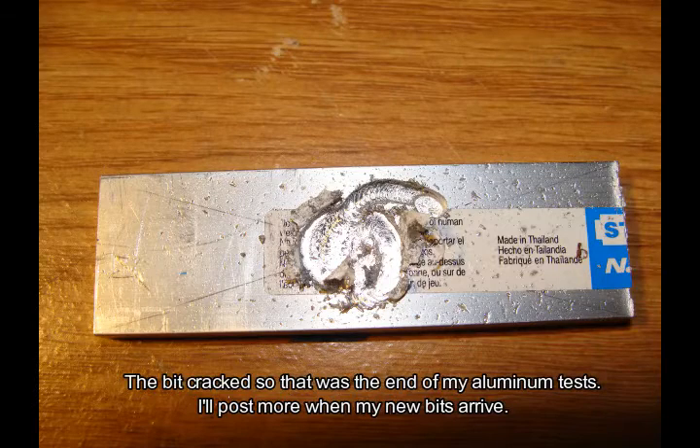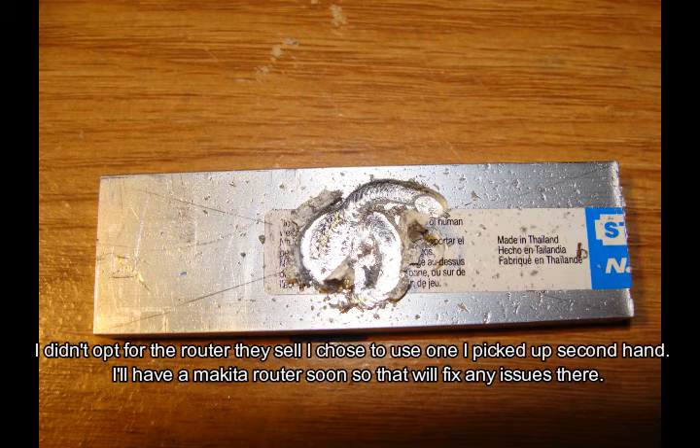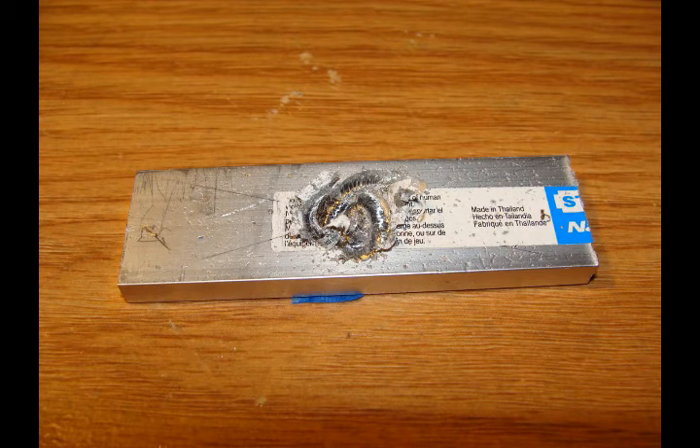What I wasn't really prepared for was the fact that my feed rate was too high, and because of that the bit that was in there vibrated loose, because it's a cheap router and the collet just doesn't hold it very well. I'm reviewing the machine, so I'm pushing it pretty hard, pretty fast. You wouldn't normally do this with the machine when you get it.